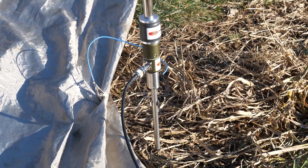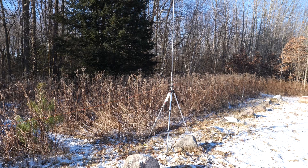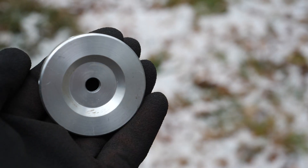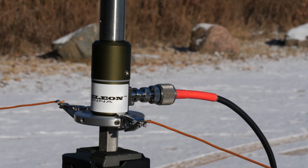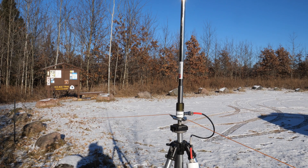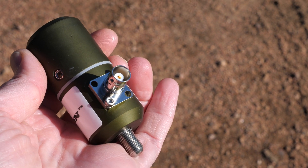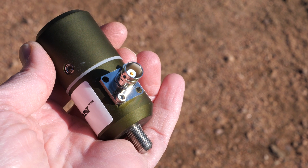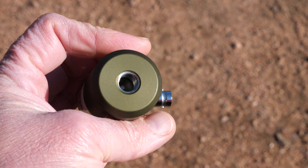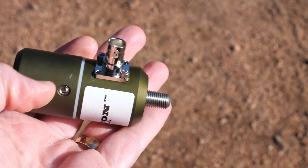Using the 25-foot SS25 whip will give you an additional range down to the 30 meter band. If you want to elevate your radiator, like with the POTA Performer antenna, you can add the puck hub to the base of the Blank Adapter and screw it onto the tripod. The elevated radials can be connected to the puck hub with spring clips or banana plugs. The Blank Adapter is rated for 300 watts SSB and 200 watts CW and digital. It is water resistant and built to withstand a variety of weather conditions, and is a welcome addition to the quarter wave resonant vertical portable antenna lover.